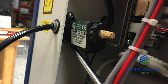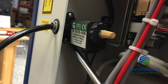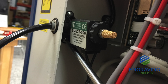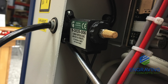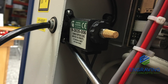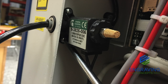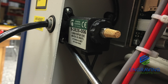To reverse the solenoid flow of air, you're going to disconnect the quarter inch black tube from the back of the machine. Then you will also use a Phillips head screwdriver to loosen the two screws to the inside. That will allow you to pull the air assist solenoid away from the unit. You're going to disconnect the other quarter inch tubing on the other side, rotating the solenoid 180 degrees, changing the airflow from the front to the back and the back to the front. Reconnect the quarter inch black tubes and then reinstall with the two screws back to the side of the unit.